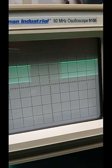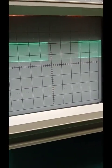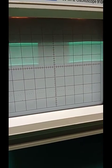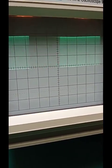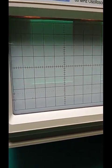Same on 20 meters with RF tune at 5. Adjusting the slugs up here for 20. And make sure not to miss and adjust the wrong slug, because then you got to go back and retune that band. Way, way off. There wouldn't have been any transmit power on 20.